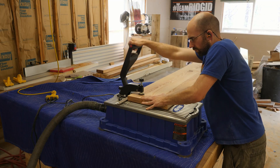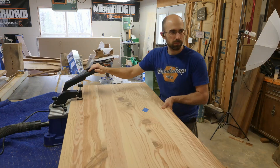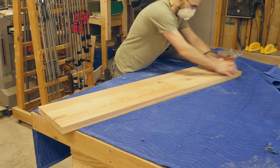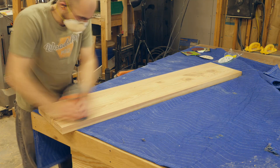The design of this bed allows me to use pocket hole screws for the headboard and footboard construction. That's because they won't be seen once everything is assembled and the mattress is in place. And now it's time for everybody's favorite step — sanding.